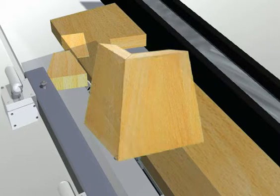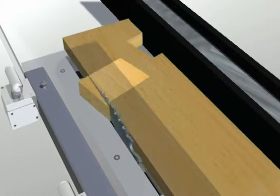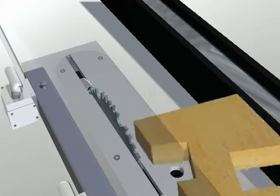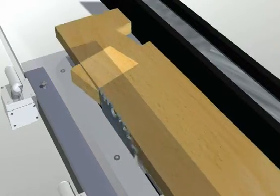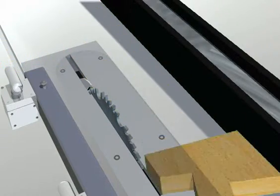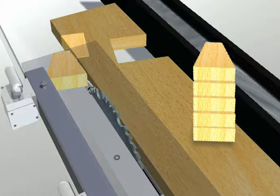The combined taper angle and blade bevel are determined by the number of sides and their amount of incline. There are charts available to determine these angles. If you have a number of cuts to make, take the time to make a dedicated jig to hold your part. Not only will the operation be safer, but you'll probably find the parts will be more consistent as well.